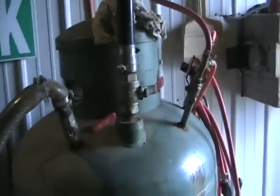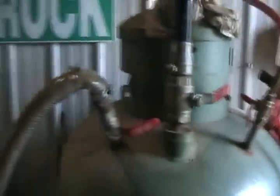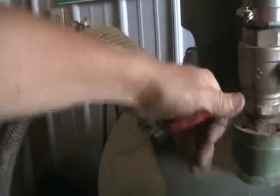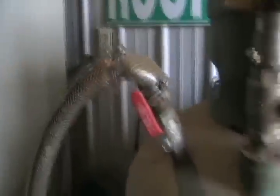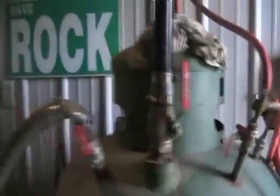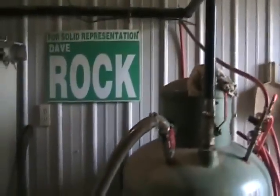I'll show how you exhaust the air out of here when you want to set it to fill mode. Imagine your system's already pressurized and you don't need any more pressure. You have these levers shut off and you want to set it for fill, which I always do when I'm not here. So you open this one and it makes a big fart — releases the pressure in the tank. Then open this one and it's just set for fill mode.